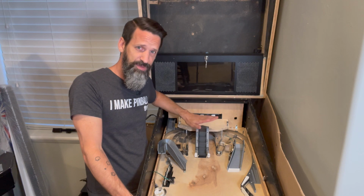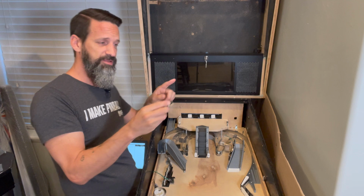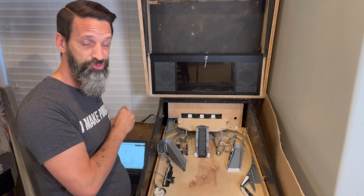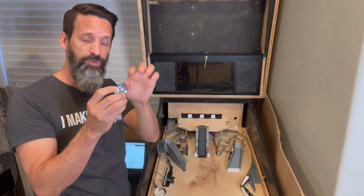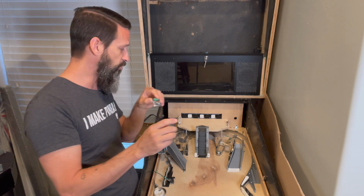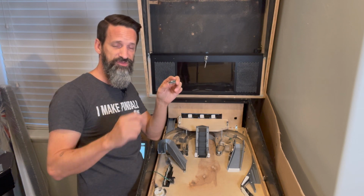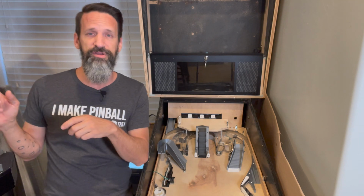Okay, to summarize, get your stepper motor, wire it to your control board, download the Pololu Tic software, the Control Center, play around with it, make sure you've got it wired correctly, make sure you have the proper power source. Go through and play around and figure out what are those integer values that you need to get it to the certain positions you want. Write those down. And then we go over to our config files.